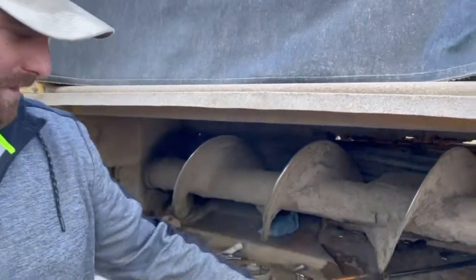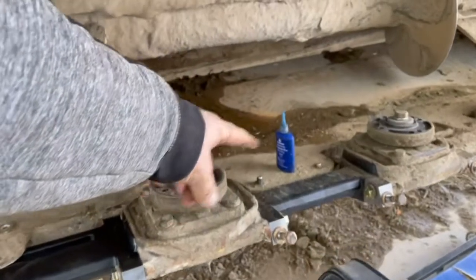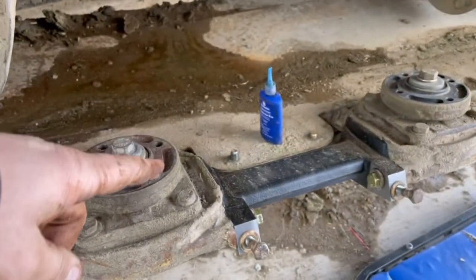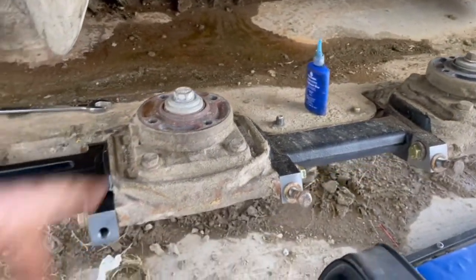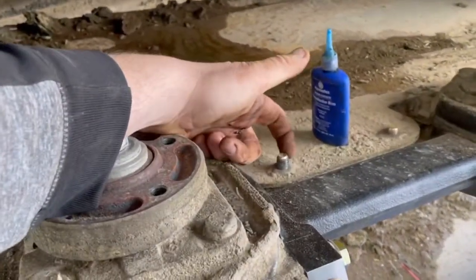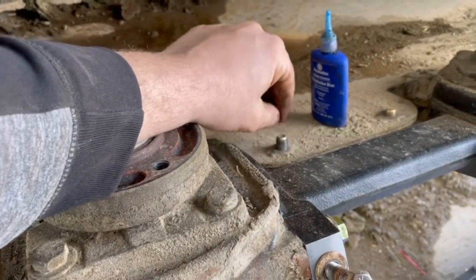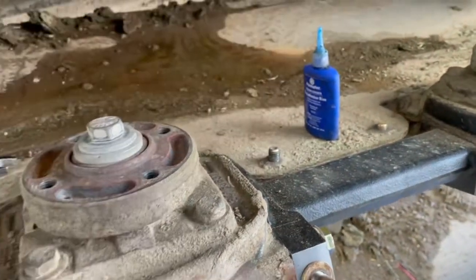And we went ahead and we slid it apart. We did that side, and then we did the center where it's got 2 holding bolts in there. We put that one in, and when you put these in, some of these were worn out and I didn't get new bolts for this, but I have bolts in my bolt bin, but they're a little long. So we're just gonna cut that down. That's all the way tight. We're just gonna take a cut-off wheel and cut that flush so that's not sticking up and hanging up on anything.